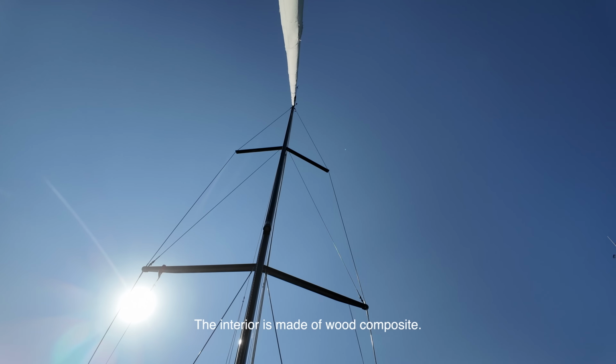Whew. These fiberglass rolls are quite heavy, 51 kilos or around 100 pounds. So I think that means that we have around 111 square meters on one of these rolls with 450 gram biax fiberglass. So as you can imagine, it adds up pretty quickly.